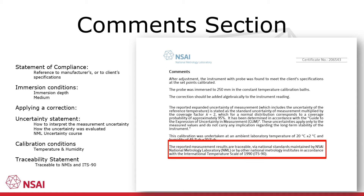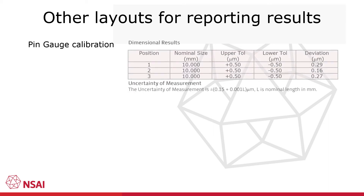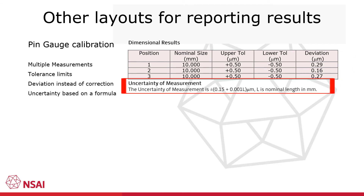The environmental conditions during calibration are also stated in the comments section, as is traceability to the standards used. The presentation of results in an NML calibration certificate will vary significantly depending on the measurements performed. Here is an example of a pin gauge calibration where multiple measurements are performed on the same pin. The tolerances are divided into upper and lower levels. The error or deviation is displayed instead of a correction, and the uncertainty is based on a formula rather than on a set value.